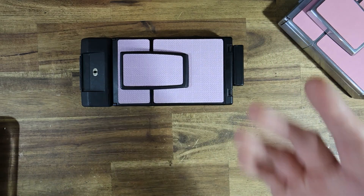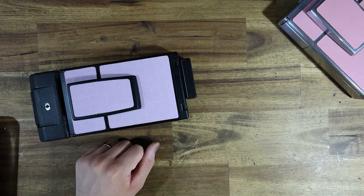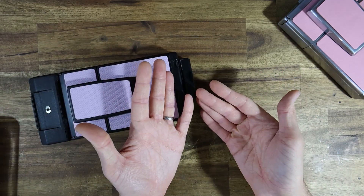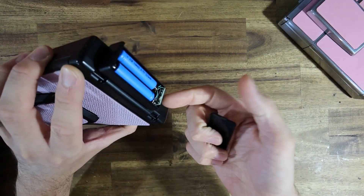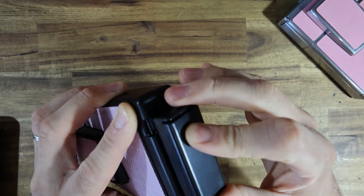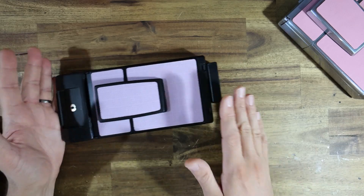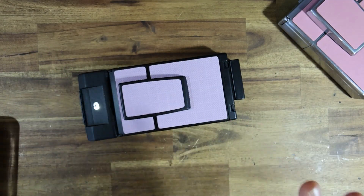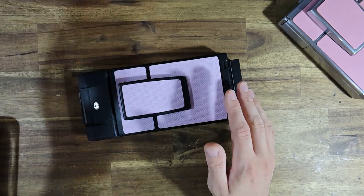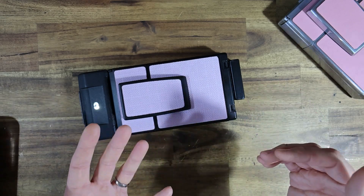Back to the pros and cons — it's very small, very powerful, and uses entirely off-the-shelf components. The new design keeps both the buck converter and the batteries completely separate from the internals of the camera, so it's going to be easy to repair. If you end up with a dodgy buck converter or it gets wet and blows up, or you put the batteries in backwards, it's easy enough to service. The parts are cheap, so I can keep the cost low. I'm going to be able to modify and install one of these for less than the cost of buying one of Retrospec's AAA battery adapters, which are about 99 US dollars.